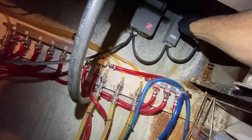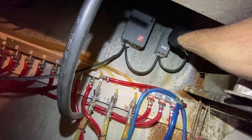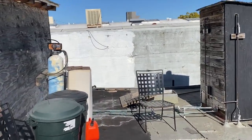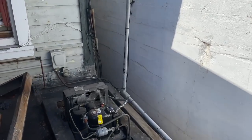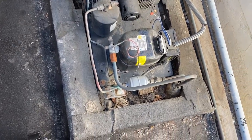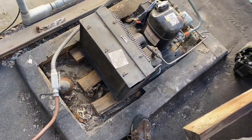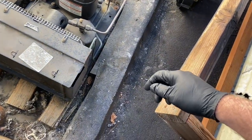The thermostat and solenoid are cooperating. Okay, let's go see what's going on at the condensing unit. There it is — they already got the little doggy house off of that thing. Used to have a high head switch on there; someone's taken it off. Because I'm the guy that put the high head switch on it. That's a shame, that's a real shame. Someone took the high head pressure switch off.